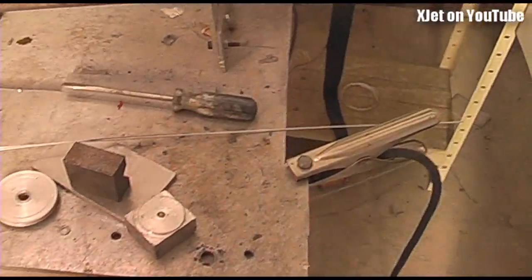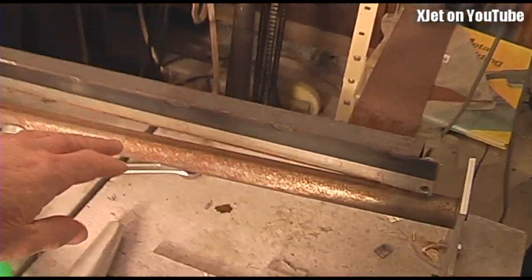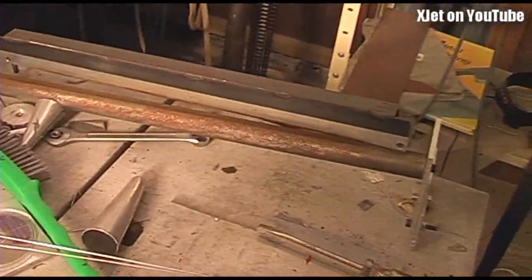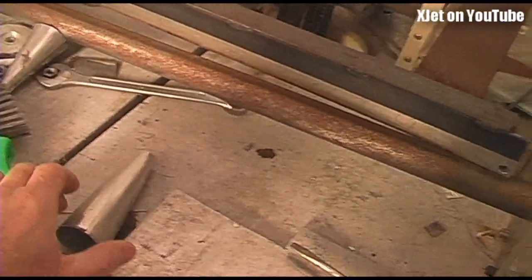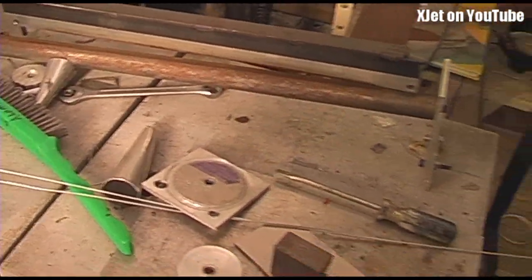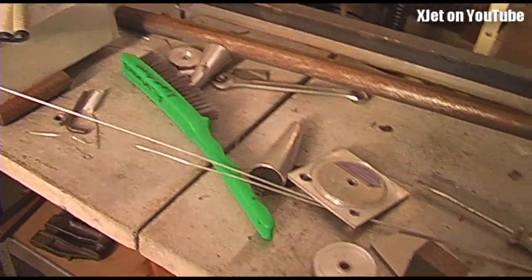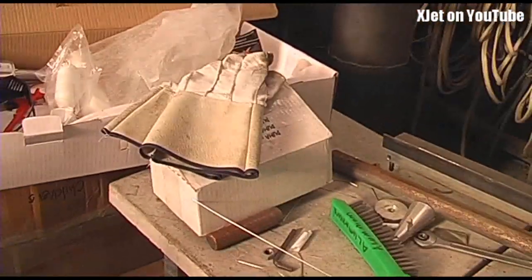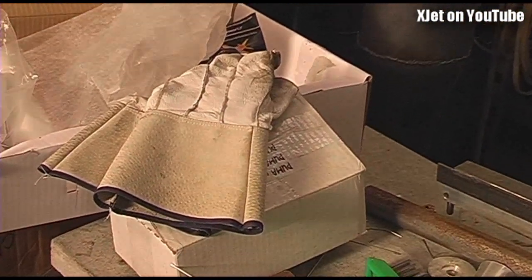This is my welding table with the earth clamp attached. This is a jig I use for holding everything together while I weld it up, and there are also a number of other pieces of aluminium I use when aligning stuff while making the engine. Bolts run through — it's quite a convoluted process, but I'll show you how it's done. We have to get everything jigged up just right before we weld. Brushes are essential because before you weld everything must be very clean, and there are my welding gloves because we don't want to get skin cancer from ultraviolet rays.